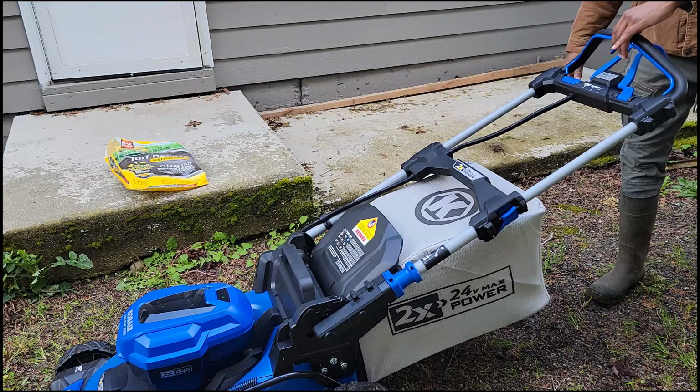Now, another thing to note is that your operation speed is going to be affected by the height of the grass you are mowing and also its moisture content. And something else is that faster speeds may choke the mower and cause it to stall due to an overload on the blade. And it can also result in your mower leaving grass strips as you mow.